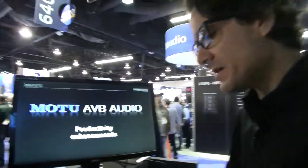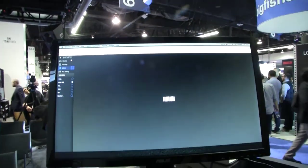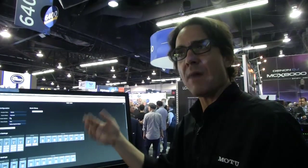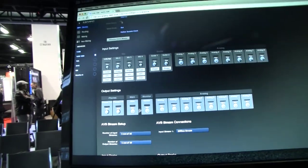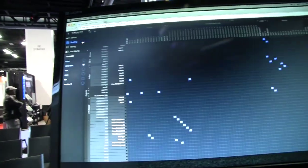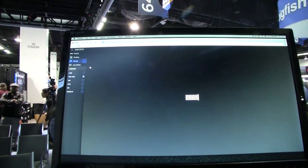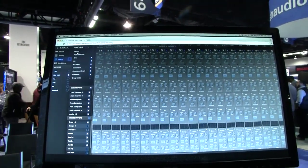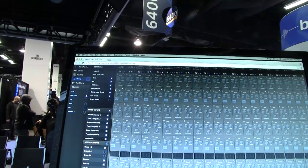I'm going to switch over to our 112D and bring up the actual device settings. This works like HTML5 editing — we're not actually going into a separate app. This is basically a web app going to the IP address of the device on the network. Under device settings, I can save my configurations, adjust my input and output levels, set up how many AVB streams we're using, and the routing matrix lets me take inputs to outputs very flexibly. Then of course the mixing environment — we've got gate, EQ, compression, and reverb built in, accessing the DSP of the AVB device. 48 channels can access this DSP.